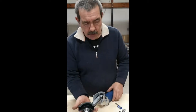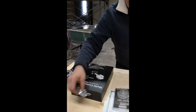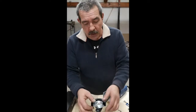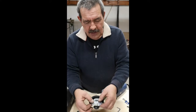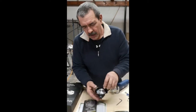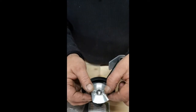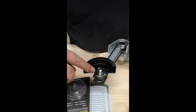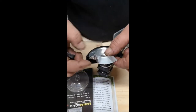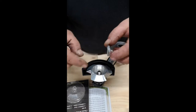Snug that up nice and tight — make sure it's nice and tight, you don't want it coming loose. Now we'll put a cutter on. Here's my cutter. I'm going to fix this cutter on here. They only go on one way; I tried to put it on the other way and it obviously doesn't work, so it's kind of idiot-proof — you can't put it on backwards. This chamfer right here only comes up into this wheel part way.